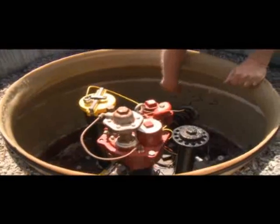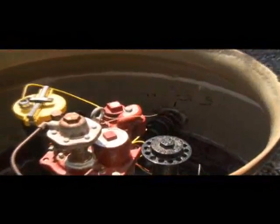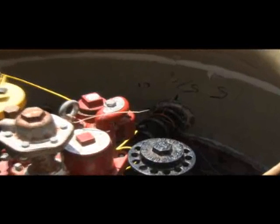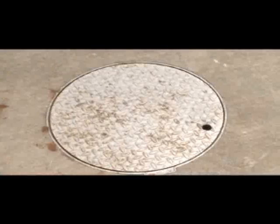The flex pipe that carries or pushes fuel to the marina dock goes through a secondary boot and is contained in a containment line. Not only is there double wall fiberglass piping, but it's also within a containment line. This is the interstitial sensor where we monitor the brine solution between the inner and outer walls of the double wall tank.